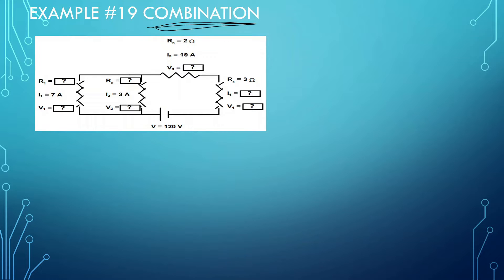So if we know that this is 10 amps, that means we also know that this one is going to be 10 amps, because they share the same electrons that flow through it — the same current — so they are going to have the same amps. Now that we know two pieces of information, we can find the third. We have 2 and 10, so V equals IR gives us 20 volts here. And over here, 3 times 10 gives us 30 volts.